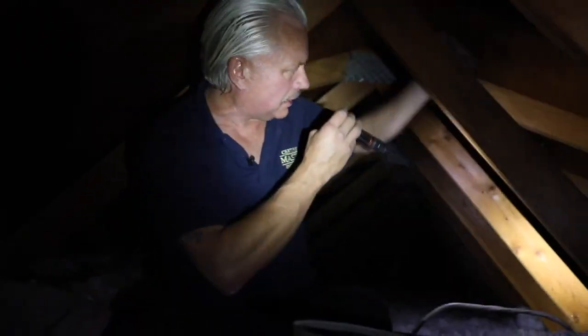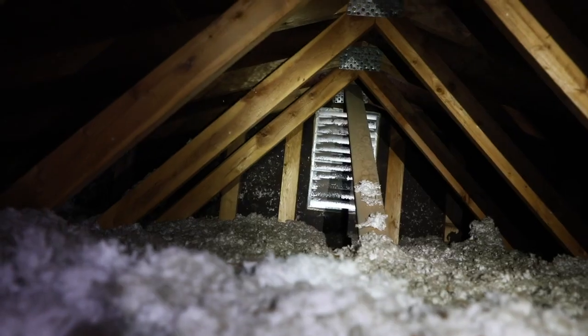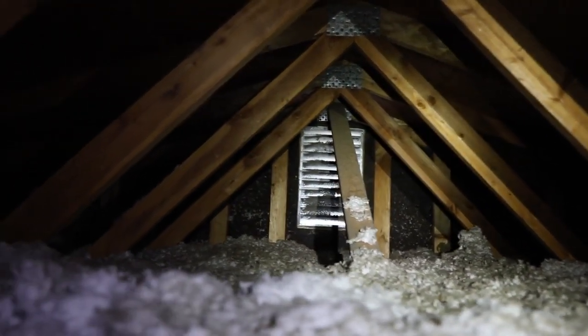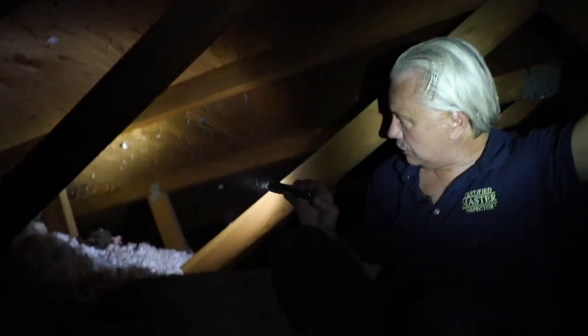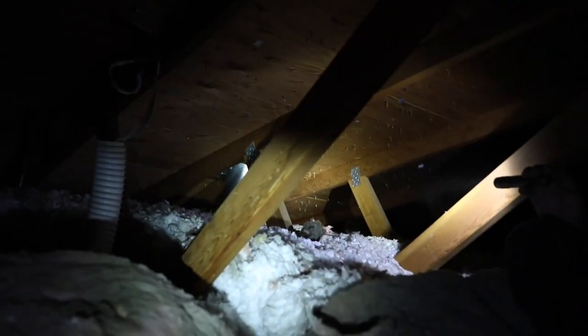The framing itself, what I can see, looks just fine. And like I said, these are trusses. Behind, again, we have a gable vent, which we wouldn't mix gables and soffits normally, but in Colorado we do. And I don't see any real water penetration by the flue right there. So even without the storm collar, it doesn't look like it's really caused a problem.